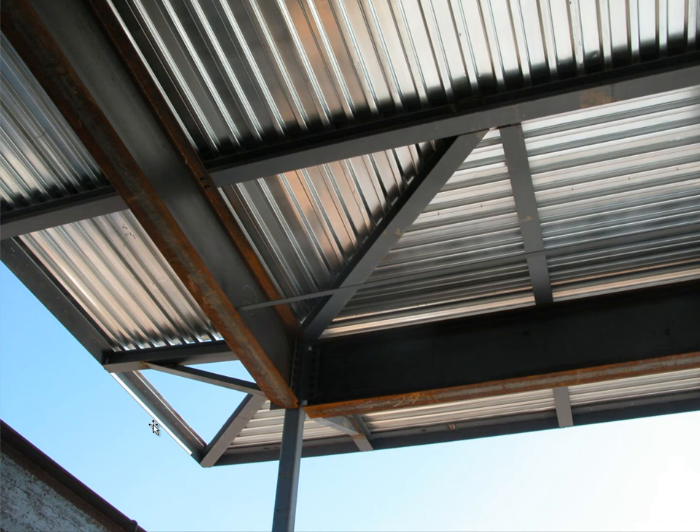Sometimes we need a double cantilever, which becomes problematical with decking that can cantilever in one direction but not the other. Here you have a corner where structural elements cantilever out in one direction to support the decking, and then the decking needs to change direction. There's a small gap at the corner where decking hasn't been installed yet, but it will eventually run from there to a mediating piece on the bias at the corner.